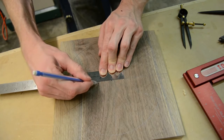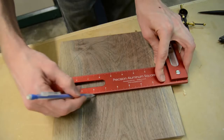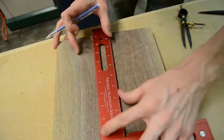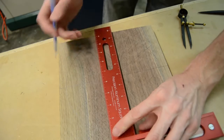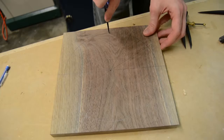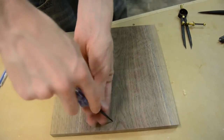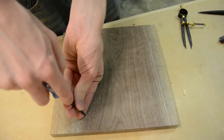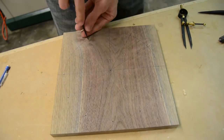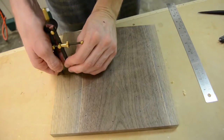To make sure each hole was placed correctly, I laid out where the movement would be on the front so I could visualize where I didn't need to drill — because the last thing I want is to drill holes into the clock face that interfere with where I have to drill the relief in the back for the movement. Once I had all those reference marks, I started laying out where I wanted the holes to be drilled, and I'm just using a center punch to give myself an indention that I can follow later with the Forstner bit.